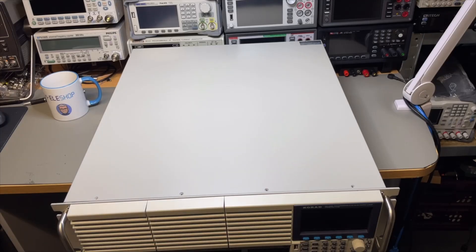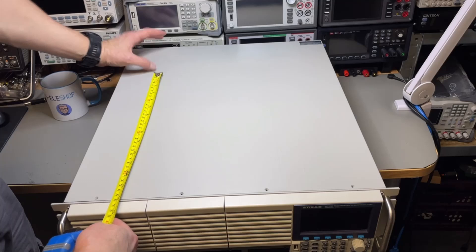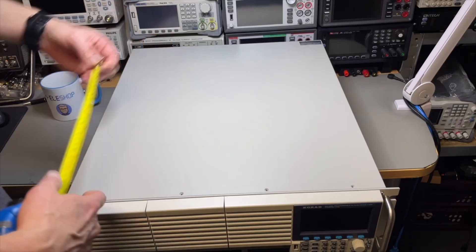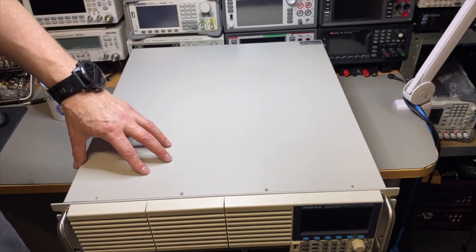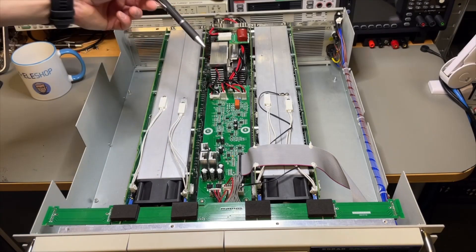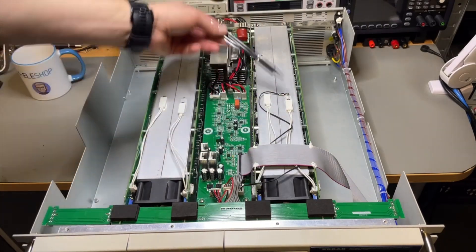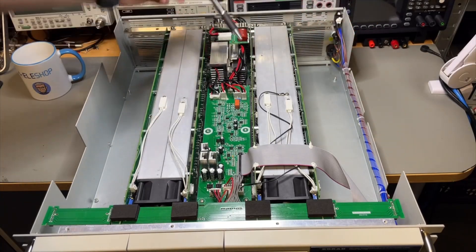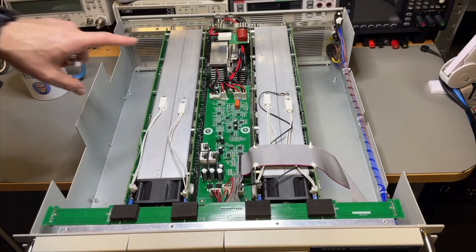When we look at the size, it is a little bit bigger than the other platform. The other was about 40 centimeters; this one is now 55 cm. But of course we have different modules now — the older one was in 500-watt increments, while this one scales at 1200, 2400, and 4800 watts. In the middle is the control unit, and on either side we have two big units, each being one of the 600-watt modules. You can add two more modules to reach 4800 watts.